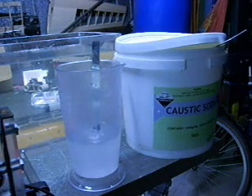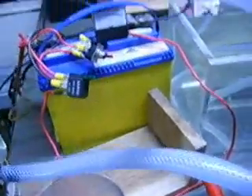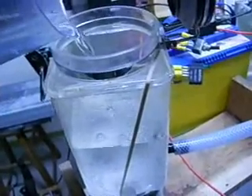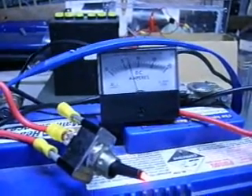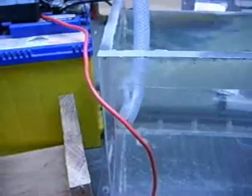So I'm going to let that sit for a bit, let it cool down, and then I'll add it into the cell and see how it goes at some higher amps. I've let this sit for a good ten minutes and as you can see it's gone all nice and clear. So I'm going to turn this back on and slowly add some of this to this. Keep an eye on the amps — because of this configuration in this cell it may take a little time to go up. You can see it going up now: up to five, up to six, up to seven. So it's sitting on about ten and a half amps now after adding all of that electrolyte. It's cruising along pretty well.